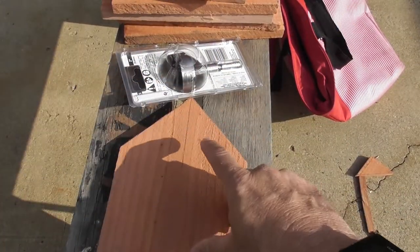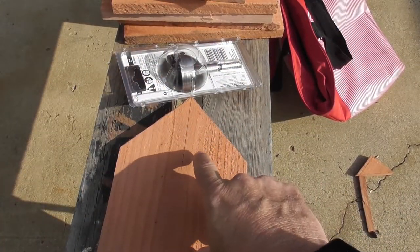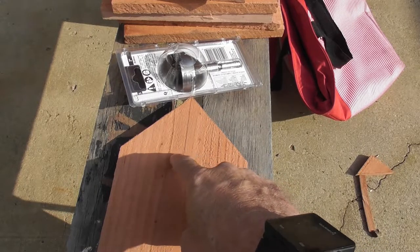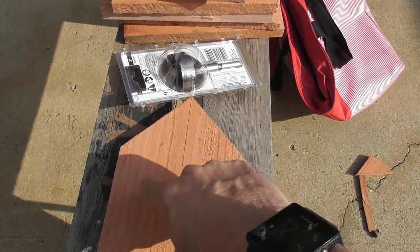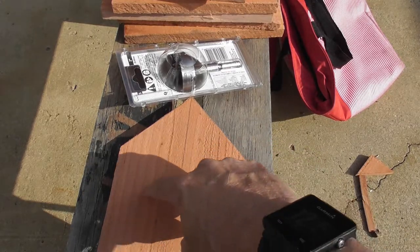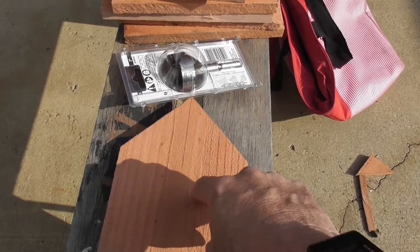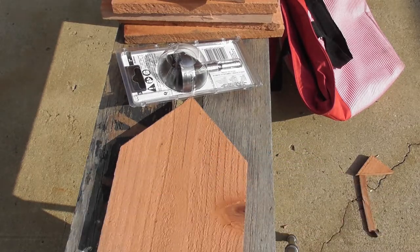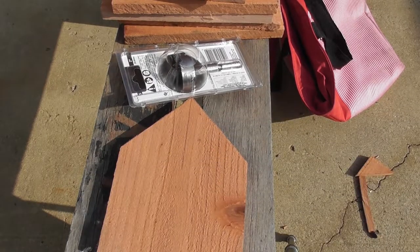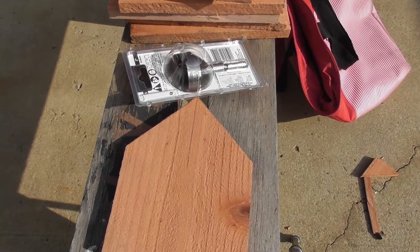If you don't want to spend $20 on a hole saw, if you're not planning to do this except one time, just make a 2-inch circle, and then take small drill bits around the circle and make a whole bunch of holes, then break this thing out and file it smooth. So I'm going to drill this hole and hopefully I will not ruin the board. Then I'm going to sand everything down and then we'll go to the video for assembly.